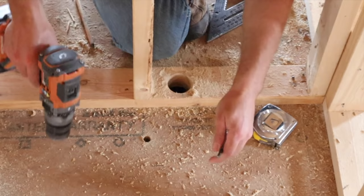Now we've got all of our rough holes through the floor done. I'm going to go underneath and hook everything together. Also note: the toilet flange has a sealed piece of plastic over the hole so when you do your pressure or water test it's already sealed. After testing, just take a hammer and smash the center out — it goes down the drain and out through the septic or public sewer.